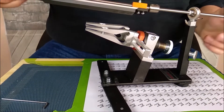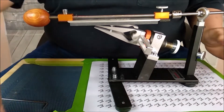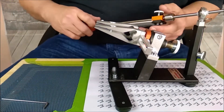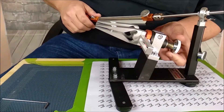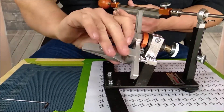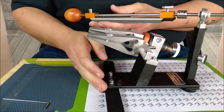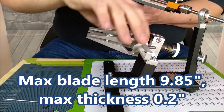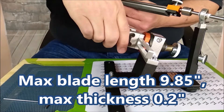I'm going to do another video on how to use it and how to use these clamps. I've used other stones that fit, and I've sharpened a few knives on this. I really like the detent for the pivot. You can change the strength of that detent by adjusting this screw here — that's really good if you need it stronger or not. It is fairly low to the table, so if you've got something long, you might have to pivot it one way and then pivot back the other way instead of all the way around each time. If you've got a longer knife especially, you'll have to do that.